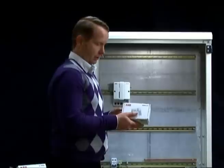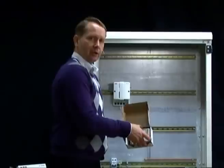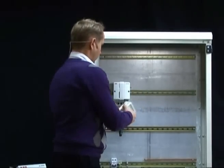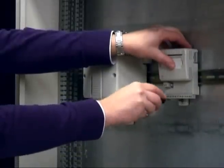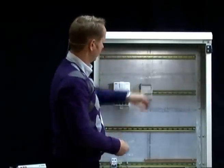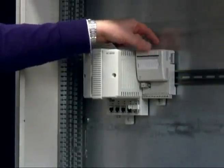The next step is to add IO modules to this lineup. The first one is an S800L IO module type, the DI801. This is a monolithic type of IO which you mount with the same type of locking devices as the controller itself. Put it onto the DIN rail, use the second position to keep it stable but still slidable. Then remove the bus termination so you can connect the IO module with the controller. Slide them together and then lock the IO module on the DIN rail.